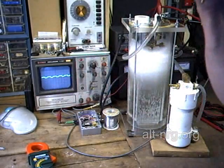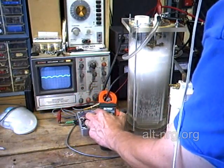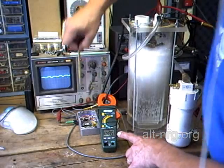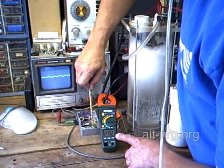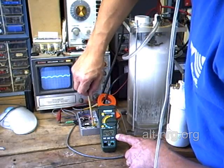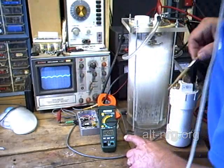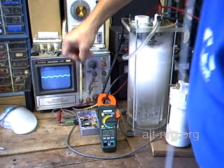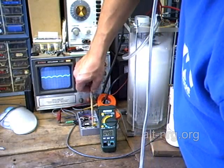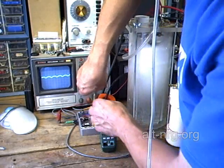When I turn it on, you'll see on the scope that I've got a pulse waveform. My zero point is here and I'm at 5 volts per division. The settling voltage between pulses is about 12 volts, which is what you'd expect for a 5-neutral plate design in potassium hydroxide. Between the settling voltage areas is the current pulse going into the cell. If I increase the duty cycle I will also increase the current.